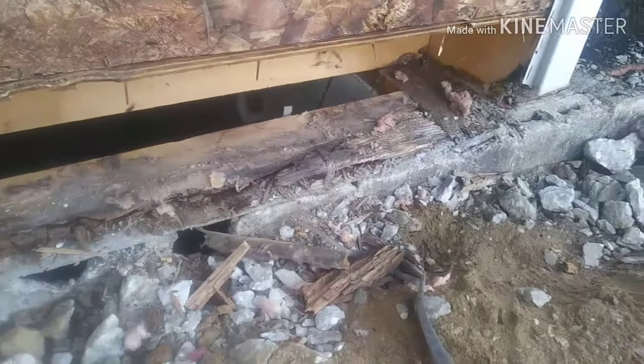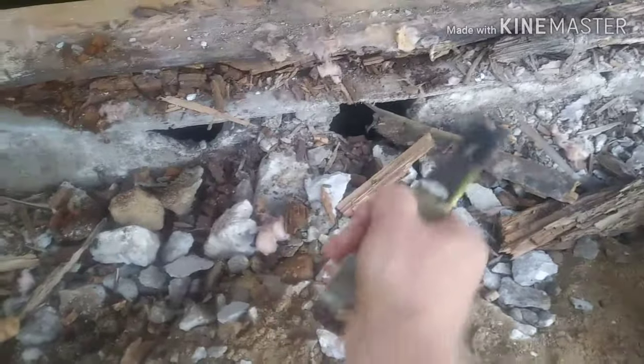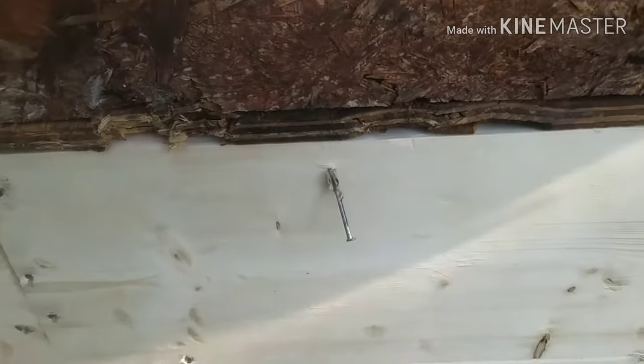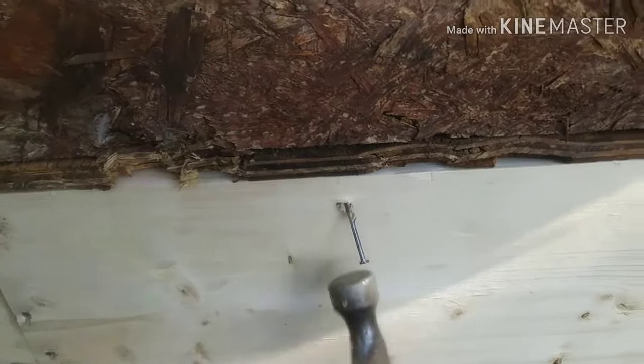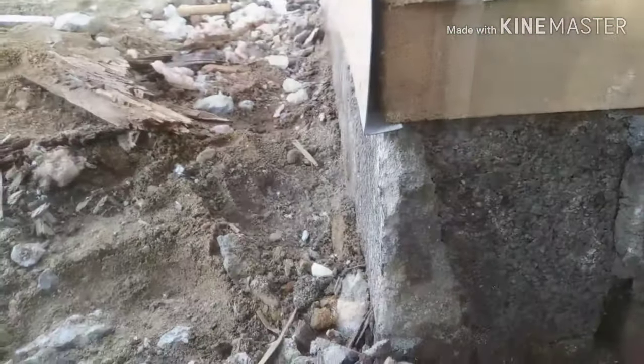I got the sill in, and after I get the rim in I'll cut the other side off and clean that out. You can see a couple of bricks there got a little damaged — the mason's going to come back and fix those after I'm done. I got half of it done; after I got that in, I ran nails up into the floor and into the bottom plate of the wall rather than trying to nail down, since there's not a whole lot to nail down into.